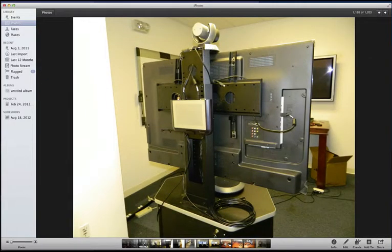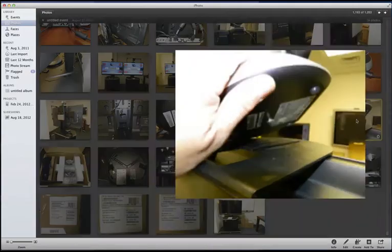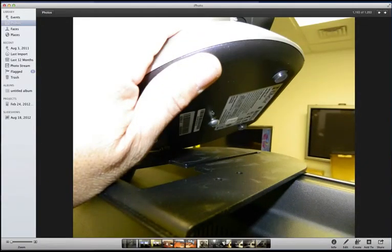So the tray is connected with these two bolts that are also affixed to the camera tray. When you remove those two from the camera tray, before you screw this in, you're going to want to make sure that you screw down the camera first. We actually left for you the small screw that's required to do that right in the camera. We left it in there so you don't have to hunt for it, but you're going to need to remove that screw, put the camera onto the tray, put the screw under the tray and screw it to the tray to keep it stable and keep it from moving around.